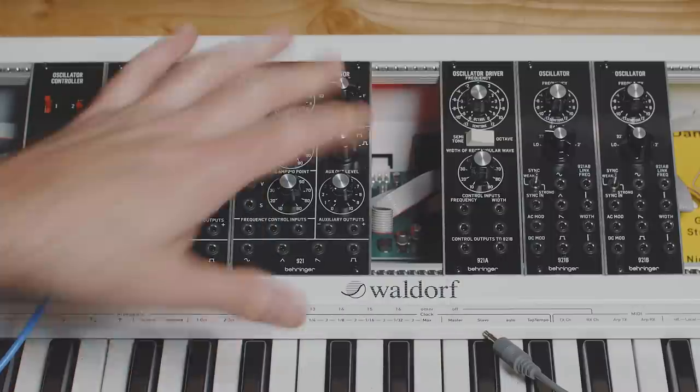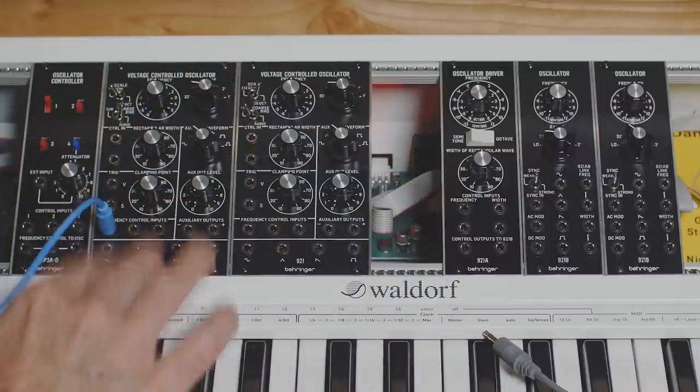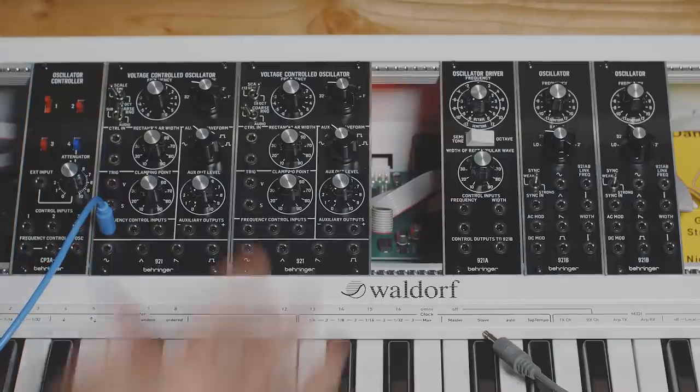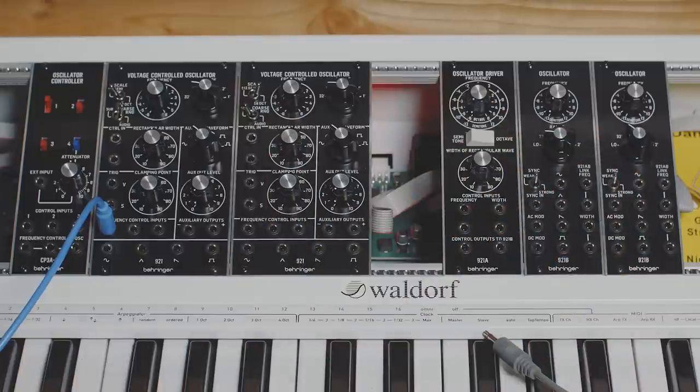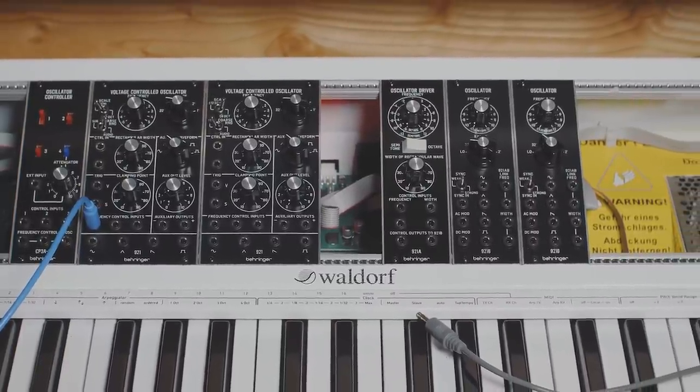Now basically, if you think about an oscillator, setting its pitch, control voltage, normally that control voltage would go from 0 volts all the way up to 5 volts, because in a system like Eurorack, which is 1 volt per octave, that gives you a nice 5 octave range of accurate pitch for playing notes across a keyboard or on a sequencer. But what if you were to send your oscillator a negative voltage, actually go below 0? What that would do is actually slow down the oscillator even more.